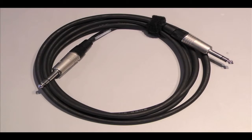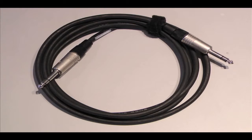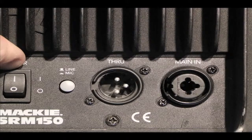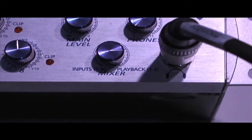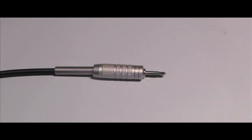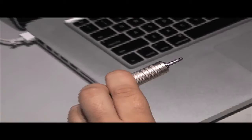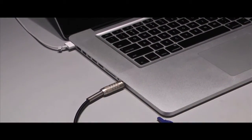The first kind of cable we'll talk about is a tip ring sleeve, or TRS cable. TRS cables usually come in two sizes: quarter inch and eighth inch. Quarter inch TRS cables are usually used to connect between speakers and amplifiers, the outputs of mixers to speakers, and are also used to connect pro audio headphones to devices such as audio interfaces. Eighth inch TRS cables are usually used to connect laptops, iPods, cell phones, and portable DVD players to standard headphones or auxiliary inputs on small speakers.